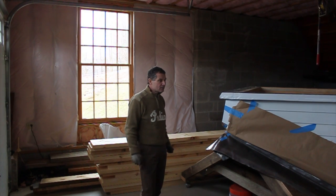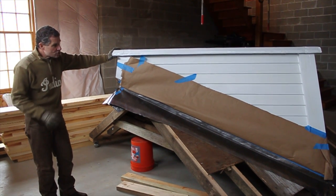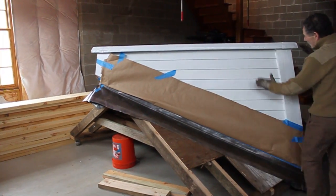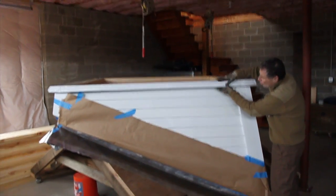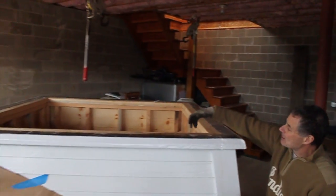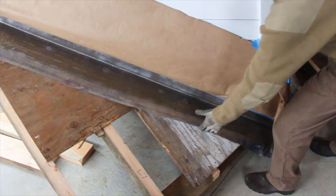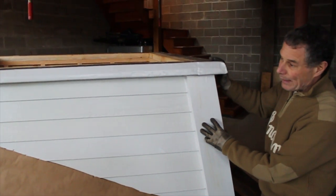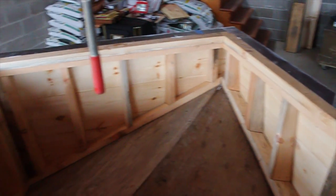The last time you saw this cupola it was in my shop and still being framed out. It's now in its finished state. We have red cedar clapboards, clear white pine corner trim, and the top rim is totally encased in lead — the lead comes almost completely over the top plate. We also put lead at the bottom where it intersects the roof, so the day the crane picks it up and sets it down, it's all flashed and ready to go. It's had three coats of paint and will get a total of five coats before raising day.